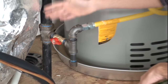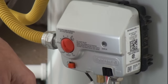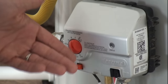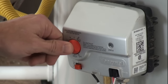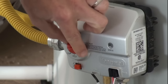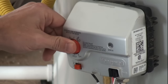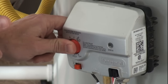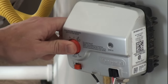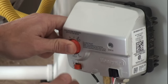Right now it's parallel and I have gas going to the appliance, so we're going to go over to this side and get this thing lit. The temperature setting is still at B, which is generally where we leave it, but notice when it's right there I don't have the ability to push this button in. What we want to do is rotate this button down to where it's directly on pilot. That allows us to push and hold the button in. Directly below that there's a little lightning bolt — that's our igniter switch. We're going to hit this igniter switch until our status light starts blinking again.